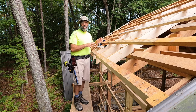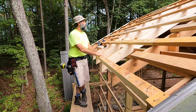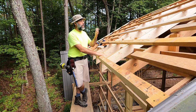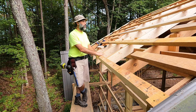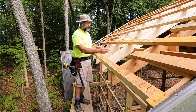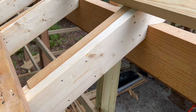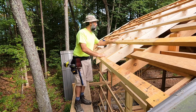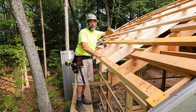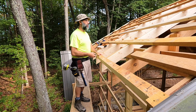Now is the time to correct any issues like this before I put OSB and an asphalt roof, because that'll make any waviness noticeable and you don't want to see that. What I ended up deciding to do was — I have loads of my own sawn two-by-sixes, but they were sawn a couple months ago and I still consider them green. So I bit the bullet, went out to the store and bought three kiln-dried two-by-sixes, and basically I sistered those up to the three boards that had drooped and put a ton of nails in there to sister them up nice. These have basically raised up my roof purlins by about three-eighths of an inch at most over the drooped rafters in the middle, and dropped the tails by anywhere from a half inch to three-quarter inch on the end. They've brought everything into alignment and everything's nice and straight.